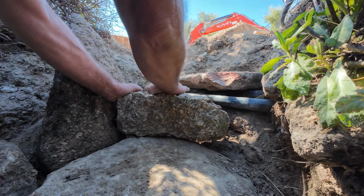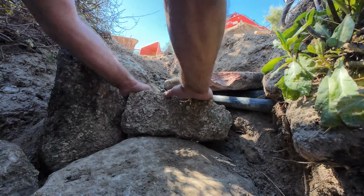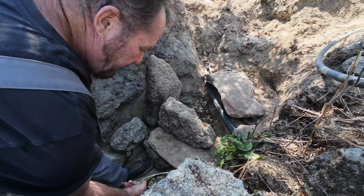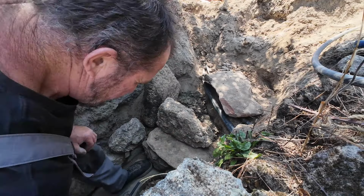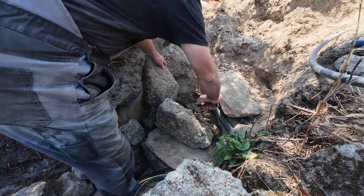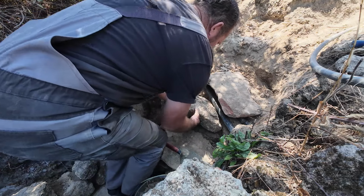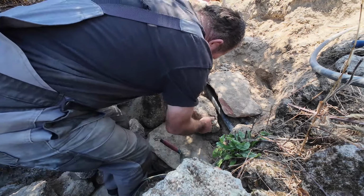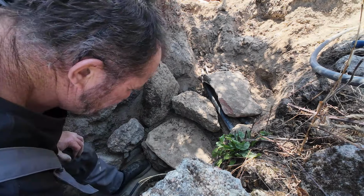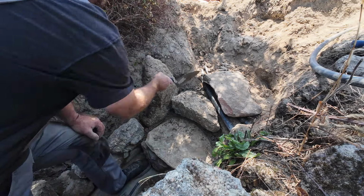Good face on it, the right height to put a little bit of mortar on top and just sink it right there. I need to fill the back with concrete, obviously. Cool. Okay, so one bucket of concrete in there already. Let's see. I'm sort of loving that. Good. I'll bring the back of that now up to underside of slab level.